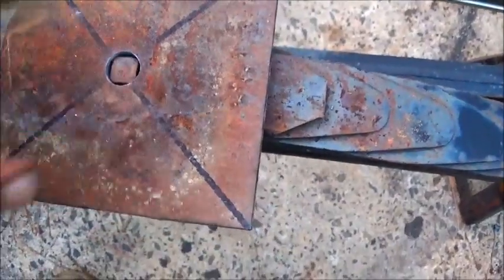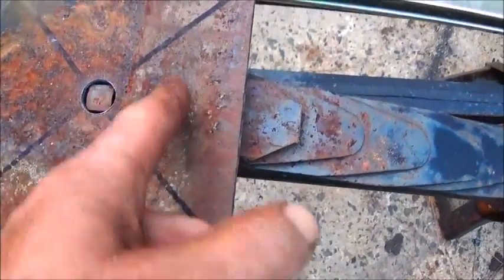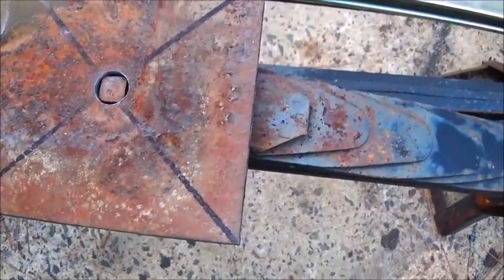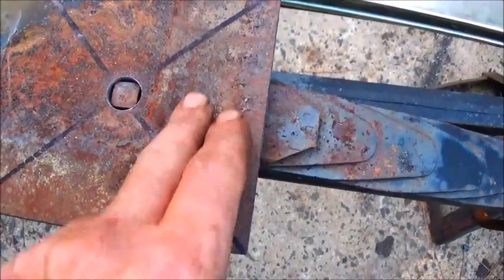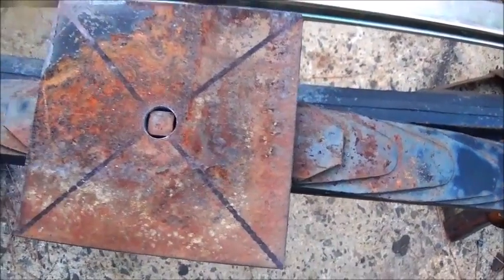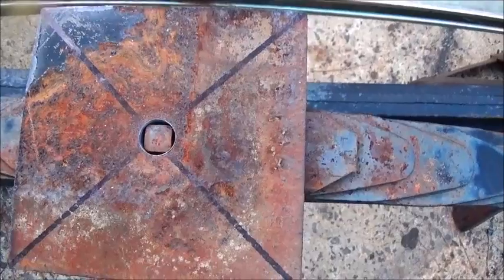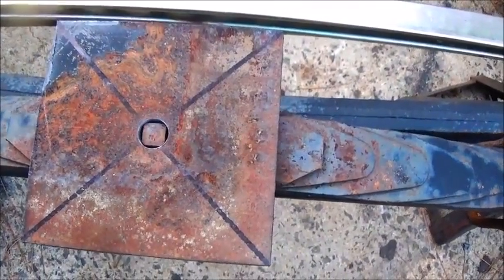And now we're going to do the other holes. I'm going to try to look and see where them U-bolts were originally spaced at, because I don't want to get them too wide apart, because it'll actually flatten the U-bolt, too far out. So I'm going to try to figure out where it was, do my holes. I can always cut this back, shorten, make it smaller. That's not a big deal. Just didn't want to get it too small to start with. But we'll see if we can get that figured out here real quick, and then we can get them 4 holes drilled.